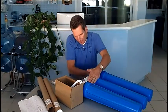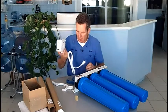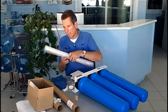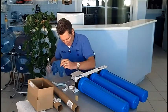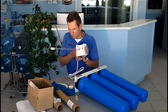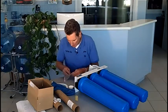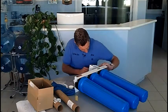The next phase is to put in the ultraviolet light bulb. In the box that holds the ballast or controller, you'll also find four screws. Remove the lamp from its container — same as the glass sleeve, we don't want to handle it directly. Unravel the bubble wrap and the four pins just get plugged into the controller. Slide it all the way in so it's nice and tight, then slide it into the middle of the glass sleeve. Before sliding it all the way in, also in the same box there's a plunger and four screws — the plunger must go into the hole beside where the ballast is located.